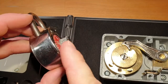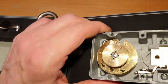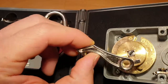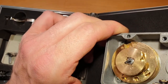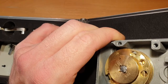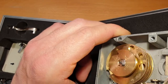The mechanics are a bit different inside this lock. The wheels are aligned such that you have a direct drive in the front — this is your third gate — and you have two wheels after which are picked up in a similar way. If I start turning, only the drive turns; this would be the third wheel in this lock. The third wheel has a gate, and at some point it will pick up the second wheel, and then the first wheel. You keep turning and at some point you pick up the next wheel. If you know the right combination, you can line up the gates.